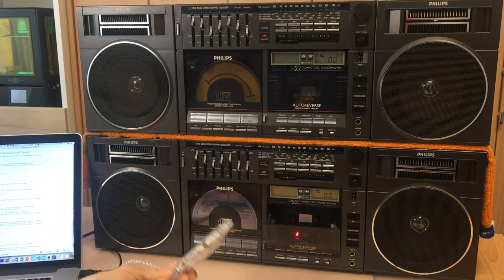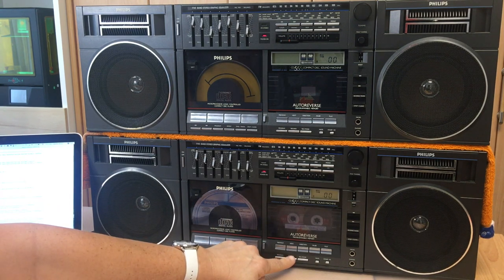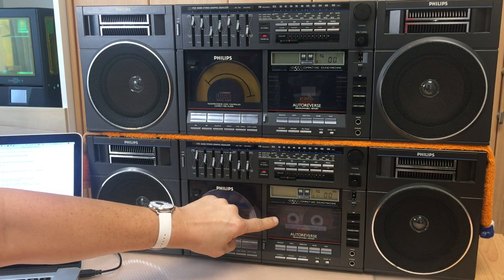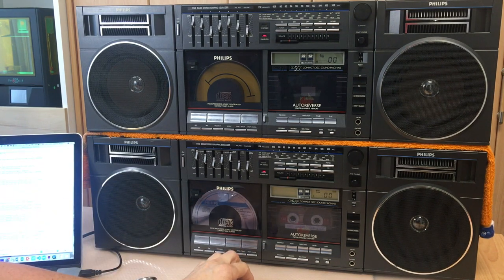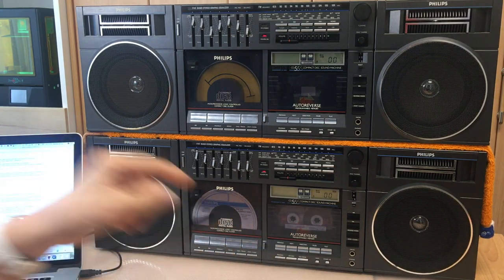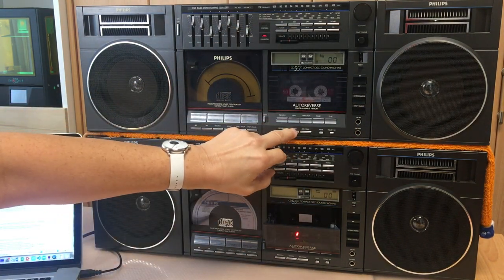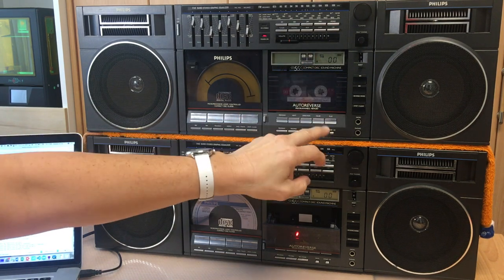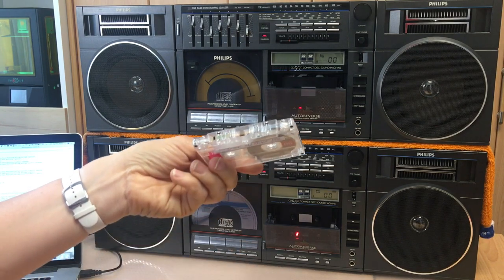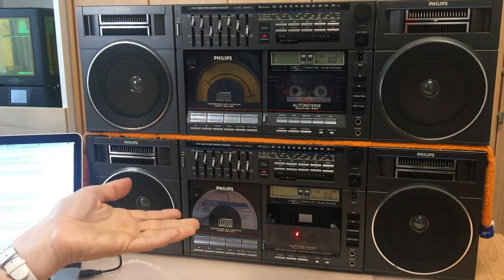But why is it doing this — does it make any sense? Yes, it does. When you want to record a song: if I click record on the modified unit, it spins forward to the beginning of the tape, finds the beginning, and then if we press record we will record the whole song. The original firmware does not do this — if you press play to start recording, you are at the transparent part at the beginning and you're not recording anything, so the beginning of a song is then missing.